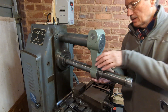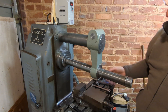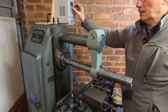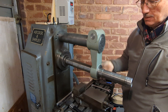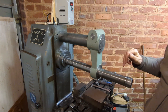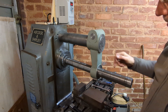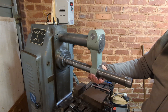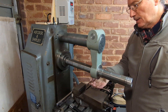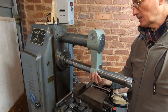It's been running now for a few minutes. There's a little bit of warmth coming through there, but that's not a problem — I think that bearing is fine. Let's speed it up a bit. As I mentioned, I'm going to have to sort the lubrication out. I think probably a hole down here or on this side, maybe with a feed cup in there. Hopefully that will be sufficient — experience is going to tell us what's necessary there.